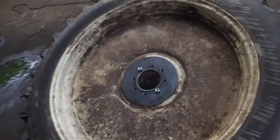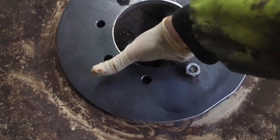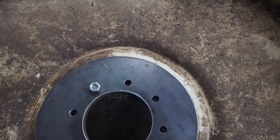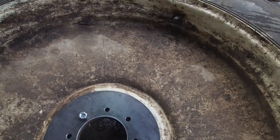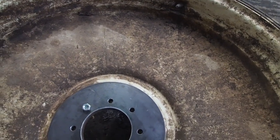and I'll go from there. I've already got it affixed with two 5/8 inch bolts. They are lined up about as close as they could ever be to the original center, or as close to center as possible. I would definitely say that they are perfect. So I've bolted them fast, and what I'm going to do is just torch it out around there, and then I'm going to knock it out,